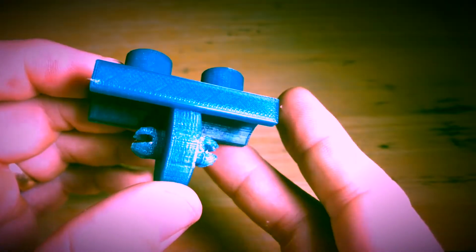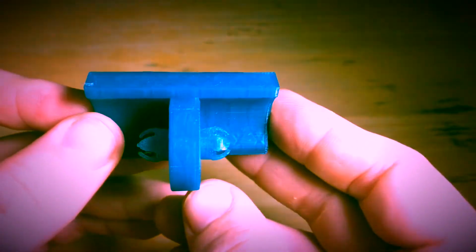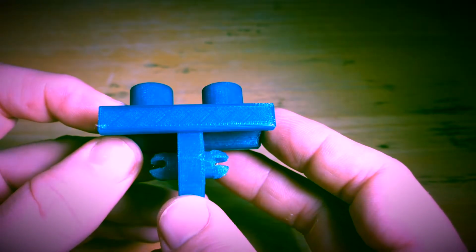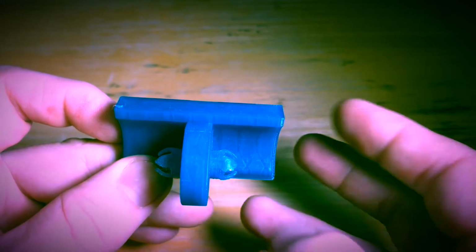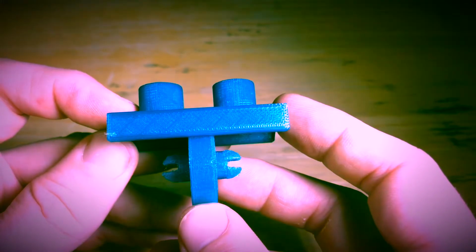You need to factor in those layers of strength when you are printing your parts. Which direction do you want to print it in? Which direction do you need the most strength? And that is a priority. You also should factor in which directions it can print nicely, but sometimes strength is the most important.